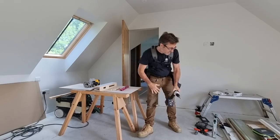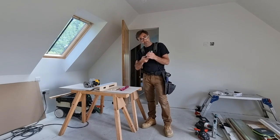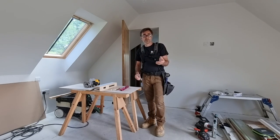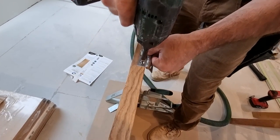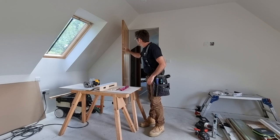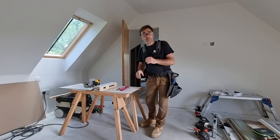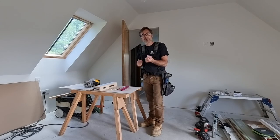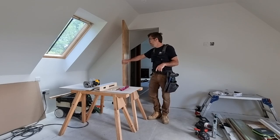We're working as a team of two. Ed follows me along — as I've routed one out, he uses his chisel to remove the last little corners for the hinge, then pilots them with these little centering bits and screws the hinges on. We start them off with a proper screwdriver, let them go through with a battery screwdriver, then finish them off by hand. A lot of the chrome screws aren't that hard — as you drive them through the first skin of oak into the softwood core they get hot and have a tendency to snap, so finish by hand.